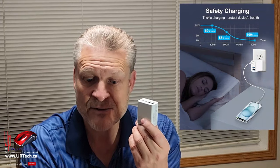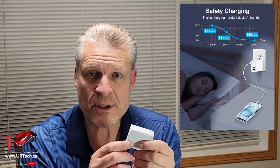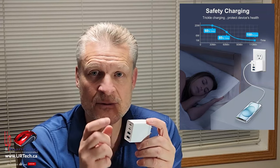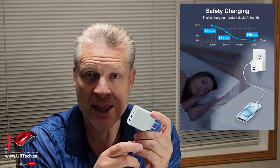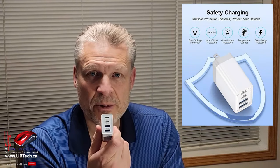Beyond wattage, make sure the charger is certified — Underwriters Laboratory certified, or CSA (Canadian Standards Association), which is used all over the world. The reason is it ensures the product isn't garbage. There are chargers that can cause problems — they can overheat and catch fire, lacking overheat protection or overcharge protection. This one has those protections. I'll put a chart up showing that when your battery starts getting full, instead of running power all the way to the end it slowly drifts down and puts less power into the battery, which damages the battery less. This one has short circuit protection, overheat protection, and overcharge protection.